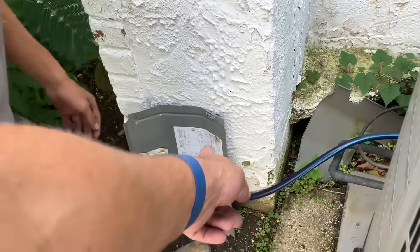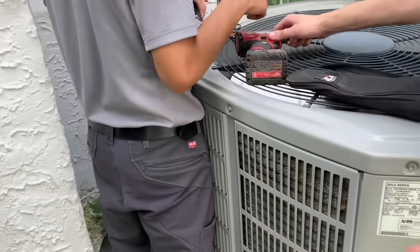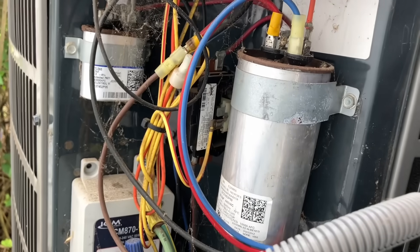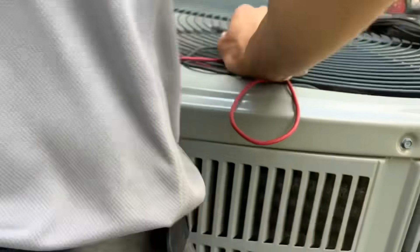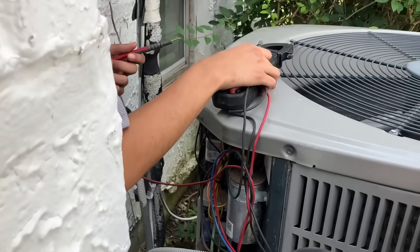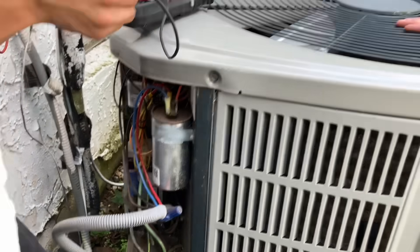What was it? On the cover? No, just mold — it's moldy. Let's see what we have in the access panel. That looks like a soft starter there, and we have capacitors. It's gonna have power because the fan is running. Got that soft starter — I got money on the soft starter. Do you think so?